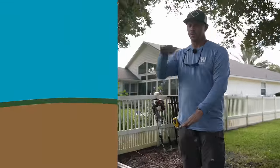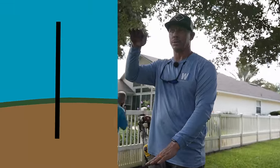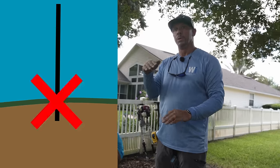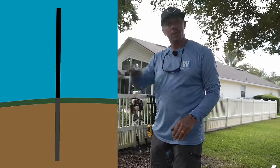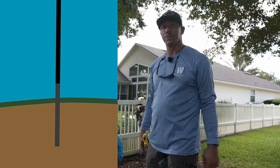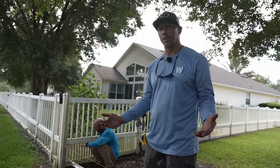Normally on aluminum fence we have maybe two feet in the ground, so if a customer wants it flat and we have a post a foot out of the ground that would be a huge problem. But because we've got four feet of post to play with, we're still three feet in the ground even though we're a foot out, and we've got no problems whatsoever. The customer can come in later and fill that off and we haven't compromised the integrity of the fence at all.